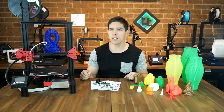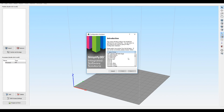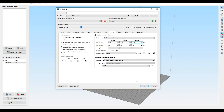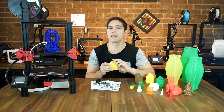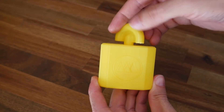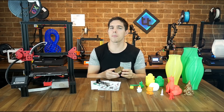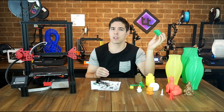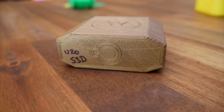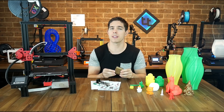The warning signs were already there, but I pressed on and decided to do my own prints with my own profile. I'm a Simplify3D user, so I went to the configuration assistant and added a profile for the Alphawise U20, which is very similar apart from the size. I tweaked the size down to match the U30 and proceeded from there. I printed a lockpick puzzle, which I'd already printed successfully on both the Ender 3 and Ender 5. When I tested it on this printer, however, I found that the internal part was fused shut — the tolerances were out to the point where the top was starting to snap in half rather than the bottom snapping free where it's designed to.